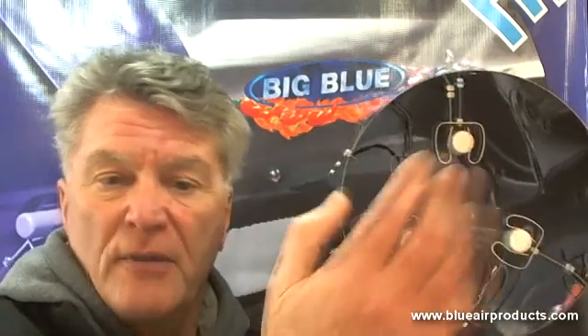What changes, other than the diameter, is the number of tubes that we include in the big blue. The purpose of that is that, let's say I have a very short run of ducting material — in other words, I don't have a lot of space to run ducting for 20 or 40 feet, depending on the CFM. If I can only run the shorter length, then what I should do is increase the number of ozone bulbs in that unit so that I'm creating more ozone to effectively treat the exhausted odor in the shortest period of time. The important thing to remember is contact time.